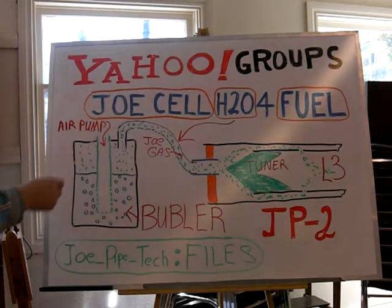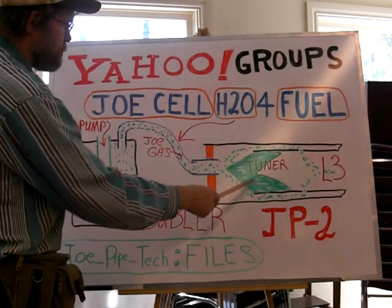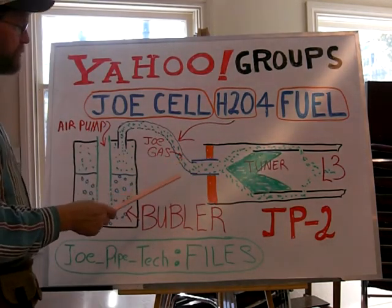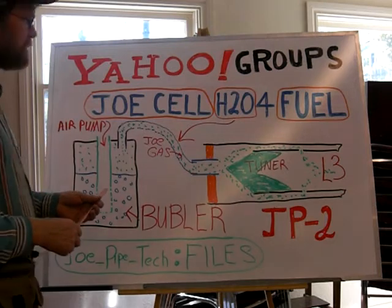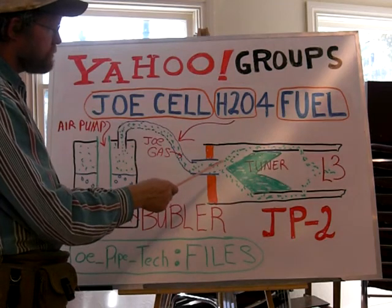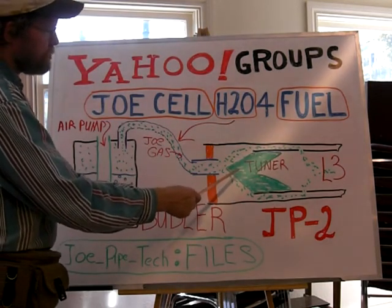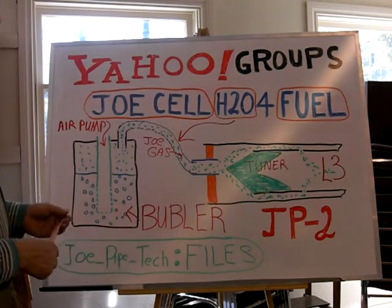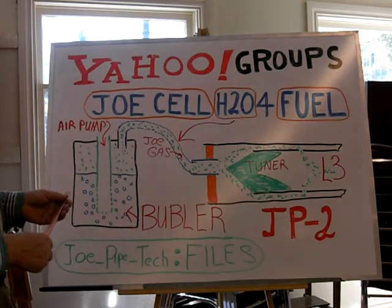Converting it from the liquid state into the gas state. As it goes into the JoePipe here, it goes around the soapstone deflector. This is more or less like a tuner, because the pipe does operate on frequency — in the same way that a pipe organ operates on frequency. You'll be able to fine tune the system to be right on key. Every pipe will have its own resonant key, and by adjusting the soapstone tuner an eighth of an inch or quarter inch either way, it's going to make a difference — improve the overall resonance, take out the noise, and smooth everything out.